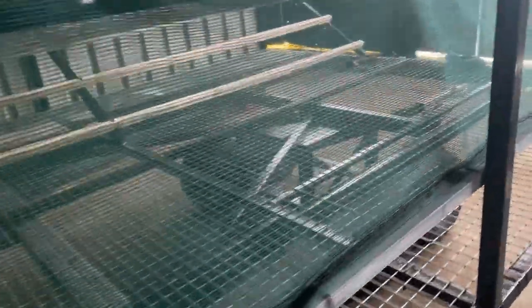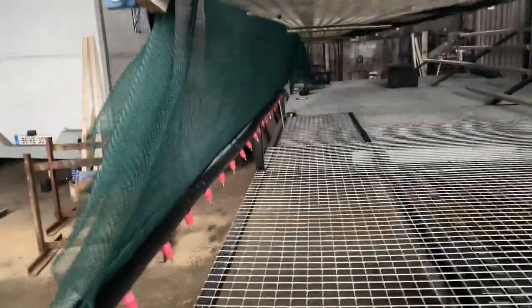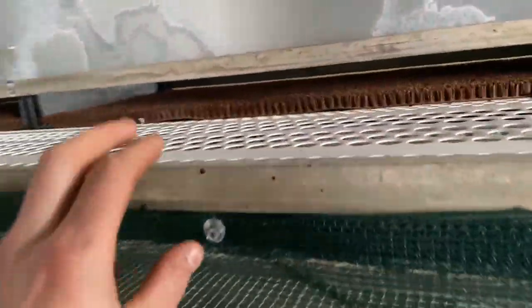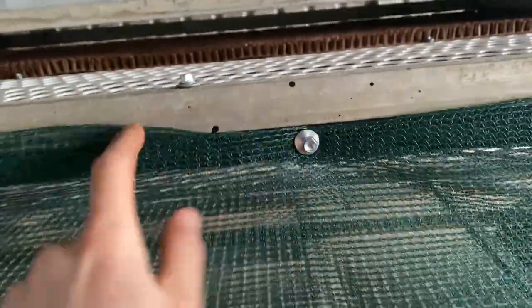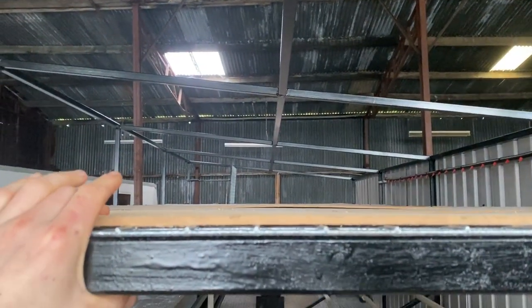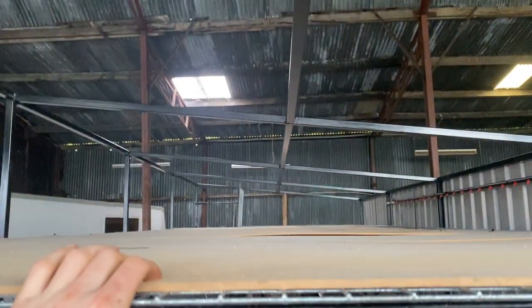I've got this little protective barrier in and that'll stop chickens from jumping up. When the nest box is leveled down, this will just hang and means chickens can't go down there and jump up. I simply cable tied it along to this bar here — I couldn't put cable ties at the top because it would have interfered with the egg belt, so we just put some hex screws in there. We've got our ply in the top. For registration, they'd probably like me to put some deep litter on this. The birds are probably never going to use up here that often anyway, but to keep everybody happy, we can put some wood chip up there and keep the regulators happy.